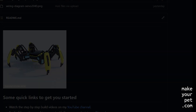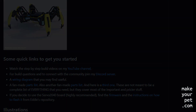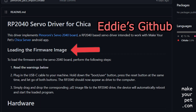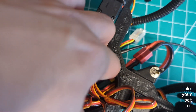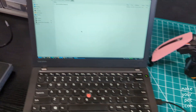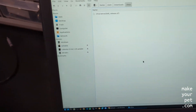The first step for setting up the software is to flash the firmware on the Servo 2040, which is pretty straightforward. Download the firmware from the link on the main GitHub repo or directly from Eddy's repository. Connect the board to your computer, then press and hold down the reset and boot buttons on the board at the same time. Once you release the buttons, the board will appear as a storage device on the computer, and all you need to do is copy the downloaded firmware into the storage device.